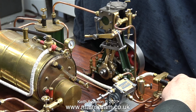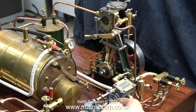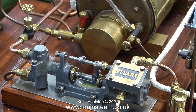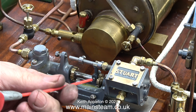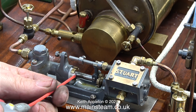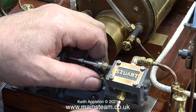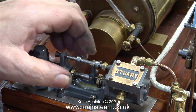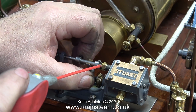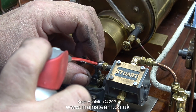The pump however doesn't seem to want to do anything. I've opened the steam valve and it's not moving, but it is very cold in here. In the steam cylinder of the pump and the valve chest will be steam oil, which is very thick to start with and it's like treacle at this temperature, very sticky. I'm going to give the pump a chance by squirting a bit of WD-40 on the ram itself, and I'm also applying some WD-40 to the valve rod. This should do the trick, and I'm sure it's going to work very shortly.